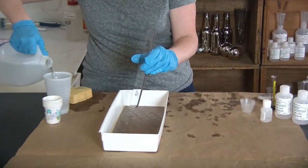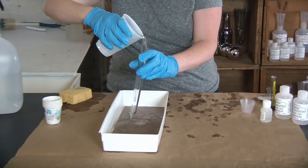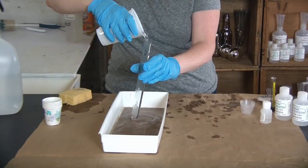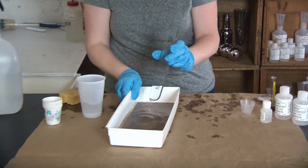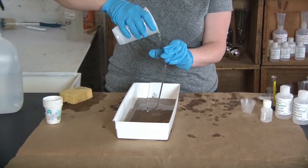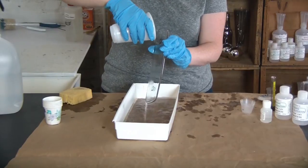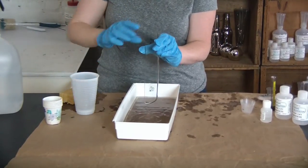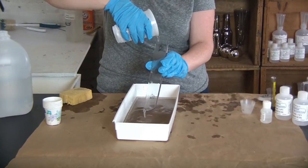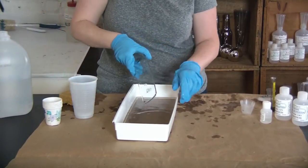With some more of my distilled water, I'm just going to rinse the surface off. About 90% of the time or more, when a person has a hard time making a perfect mirror finish, it's because of one of two reasons: one is the cleaning — that the surface of the glass was not clean enough — and the other results in issues with the tin, either not enough tin for silver adhering to the glass or it wasn't rinsed off well enough. So you always want to take your time and use plenty of distilled water. The tin for silver that I need has already adhered to the glass even though you can't see it, so I can go ahead and rinse away knowing my surface is good to go.